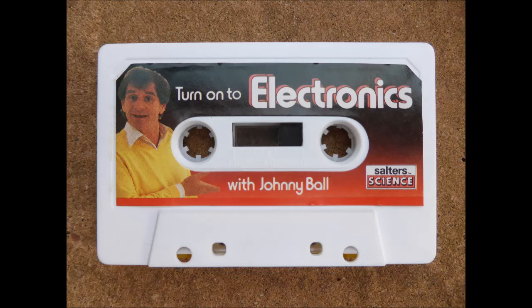Another controller of electrical current is the transformer. This contains two coils of wire, one smaller than the other. These coils are not connected to each other but they are wrapped around the same iron core. When AC or alternating current flows through one coil it makes the iron core magnetic and the magnetic field in turn starts an electric current to flow in the second coil of wire. Because the two coils in the transformer are of a different size, the electrical output from the transformer is different from the input, but the two electrical forces are always in the same proportion to each other. So by increasing the input to a transformer you increase the output in a controlled way, as you will see — or rather hear — when you make the police siren.